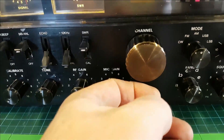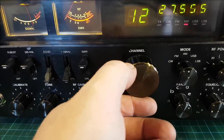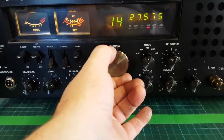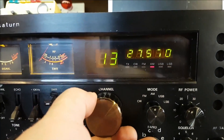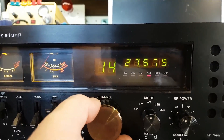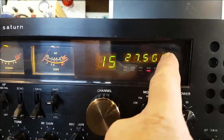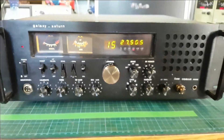I'm a bit concerned about this — hoping the encoder is okay. It seems to work okay. It's actually two segments out on that; you can see the middle of the five is missing and part of the eight is missing as well. It could be just dry joints or something like that.